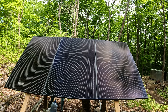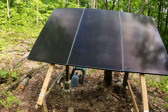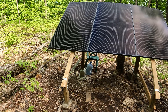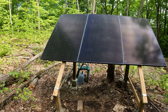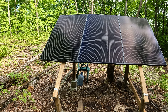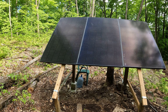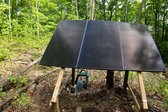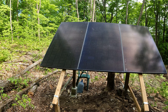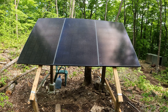This is my solar mount. I was going to use unistruts, but when I looked at the cost in Canada it's so expensive. Initially I thought if I designed a unistrut system I could manually adjust the solar panels for the season — in summer increase the angle upwards towards the sky, and in wintertime lower them down so they get the reflection from the snow.